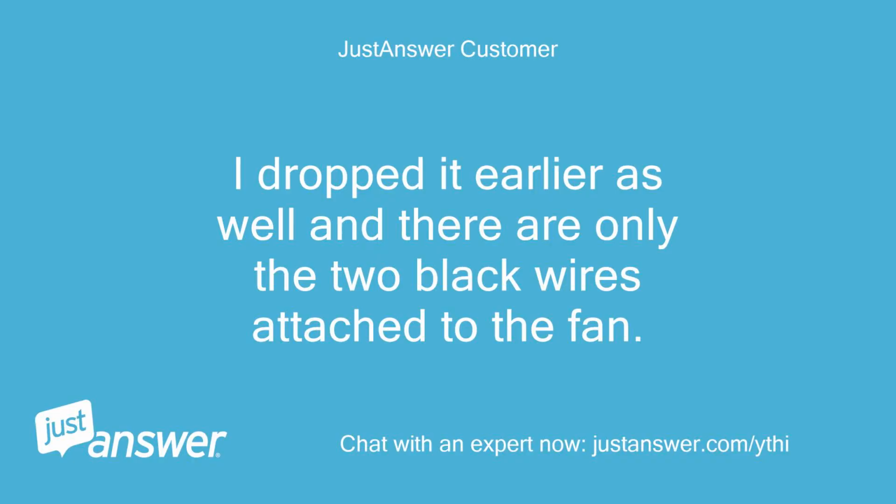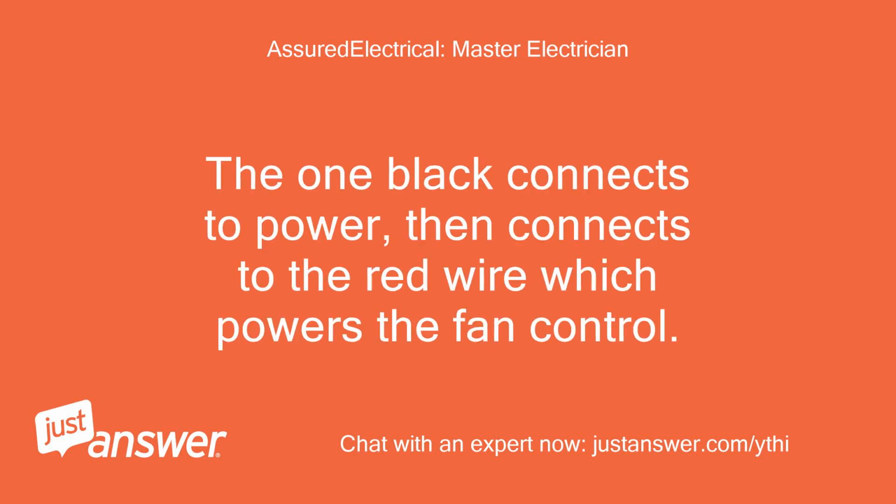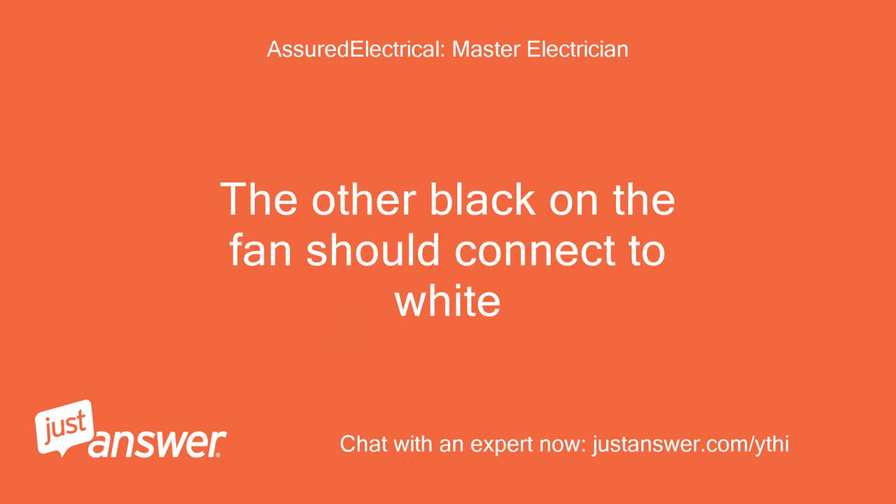I dropped it earlier as well and there are only the 2 black wires attached to the fan. Okay, thanks. Connect that shorter black wire to the whites and that should take care of the fan operating. The 1 black connects to power, then connects to the red wire which powers the fan control. The other black on the fan should connect to white.